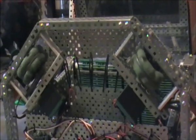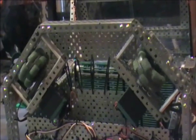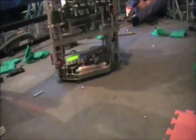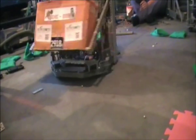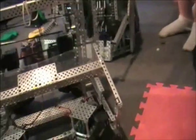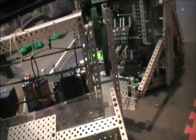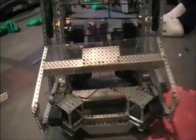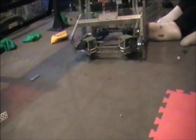This chassis is built from four self-contained wheel modules and can be built with big or small wheels without too much difference in build time or effort. Small wheels give the robot a lower centre of gravity which makes it less likely to tip over. They have more torque than big wheels and less inertia to overcome when you start driving. Big wheels are faster than small wheels when driving at full capacity and they drive over stacks much easier than small wheels.